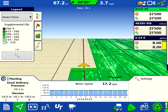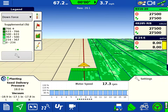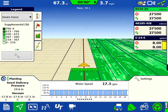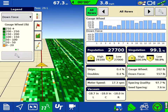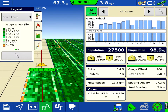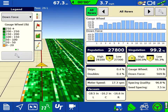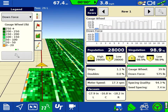We haven't had a lot of rain and the ground is quite dry and very hard, running in a no-till situation. On top of that I have cutting coulters and clean sweeps on this planter, so I need a little bit of extra downforce to begin with. We did have to bump it up from the stock 450-475 settings, and I'm actually up to 575 for maximum downforce.